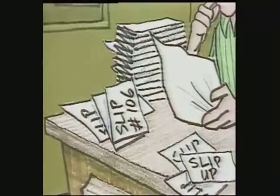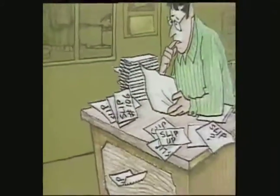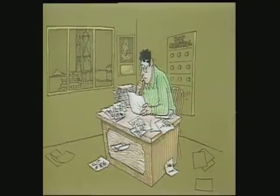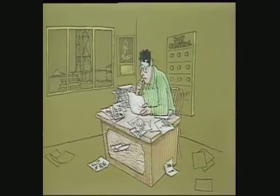Chances are your policy calls for a cut every time you slip. The reasons for this are it eliminates paperwork and chances of error due to poor communications, and the benefit of slipping 30 feet may be outweighed by the expense of the downtime performing the slip. It's very common now to run a line a little longer, skipping the short slips, and slipping and cutting at the recommended cutoff interval. Instead of halting drilling three or four times, we stop only once.